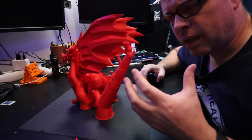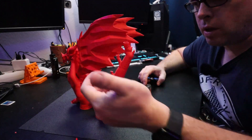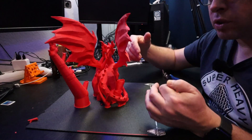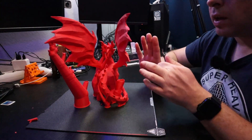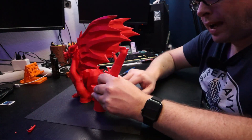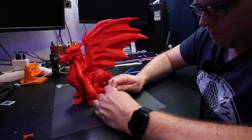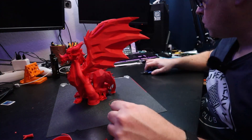As you can see I'm trying to go with the direction of the model. There is some wobble — the walls are three, which should be more than sufficient, but since I have an infill of 10 percent it's not very stiff. For the model itself it's perfect and fine. I need to disconnect this part first, then I can remove this support. The remaining supports will be removed after the model is completely free. Good bed adhesion — very important.